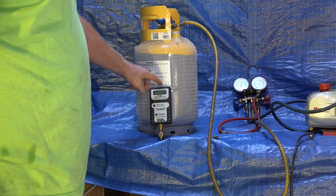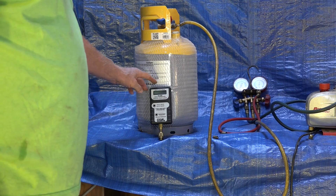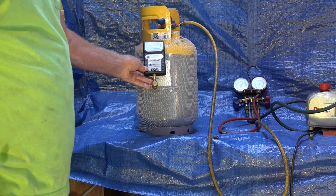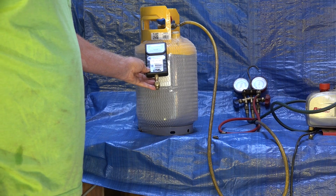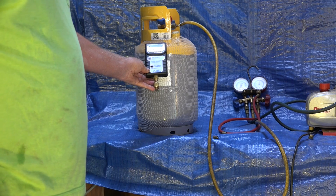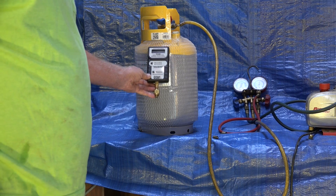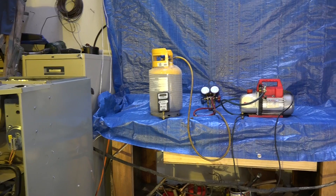In this case I'm going to use this gauge here. A little bit about this gauge — it's a JB. You can see I have a plug in the bottom of this thing. You should always have a plug down here; don't leave this thing open to the atmosphere, it's just not good for the sensor. Also try to keep oil out of it.